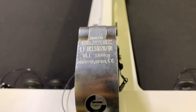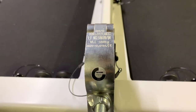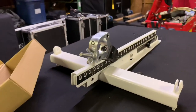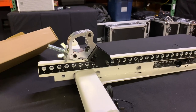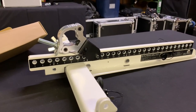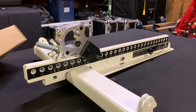It shows you the weight rating right on the unit: 560 kilograms. Multiply by 2.2 for the conversion to pounds — this little unit can hold well over 1,100 pounds. There's no way 16 modules of cabinets weighing a little over 25 pounds each can ever add up to that, so you're well within a safety factor. If you have any questions, just give us a call.